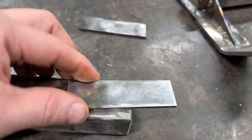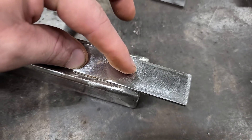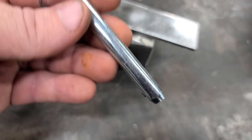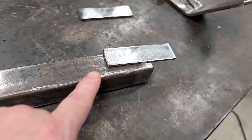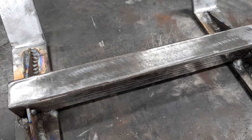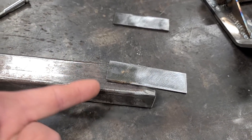These pieces are going to go on the top section — one on each side. They're going to have a hole at the bottom and a hole at the top. The bottom will have a stainless steel bolt running through it, and the top hole will take a pin that's got one of these ball bearings in it. Basically this bracket on this anchor is going to make it so you can fold the top down and make it more storable — so it's going to turn into a folding anchor. Next I need to drill my holes for these brackets and then weld them on.